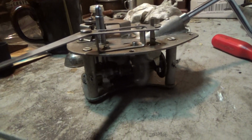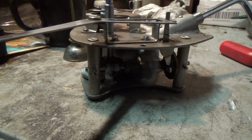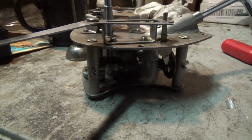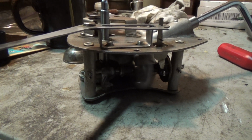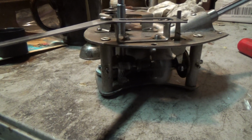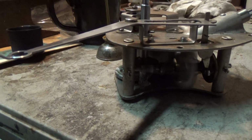We had problems with the bearing caps here, this one in particular, that had been allowed to rust. The ball bearing was rusted into that little cup. They are steel, they're not brass. Lack of lubrication over many years caused just that one. The other one came out for me, no problem, but this side, nothing I did would get that ball bearing out, so I had to source one from a Victor. That's a Victor cap in there with a ball bearing. No problem, fits right in. It's a direct replacement.